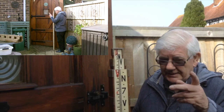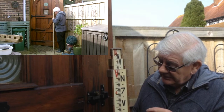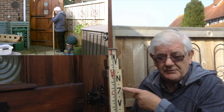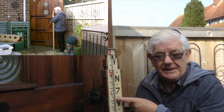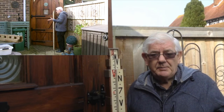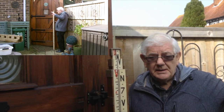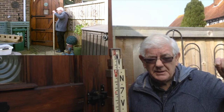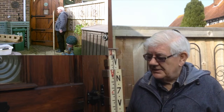When you look through the level the image is upside down, so when giving instructions to people, when you want them to move down you say 'up'. You usually signal this by going up, up, up, up, then down, down, down. When you get near to the line you signal a little bit, then switch — and then it's done.